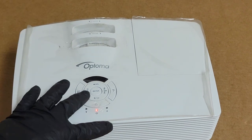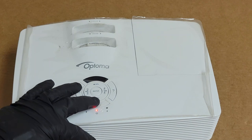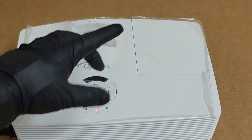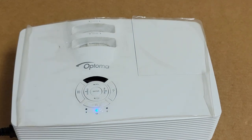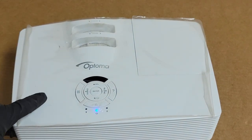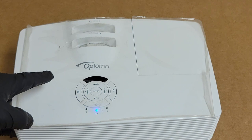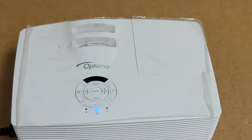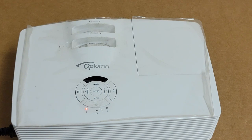That color wheel's chirping all over the place, though. So either the wheel's bad, or maybe the wire got bent or cracked or something, because it sounds like not all the coils are being fired. So there's 3 poles on that motor. Chirp, chirp, chirp. Angry squirrel inside. And that's the motor jamming that noise.